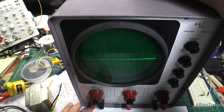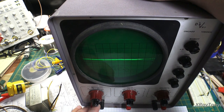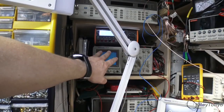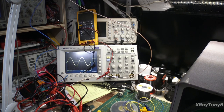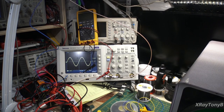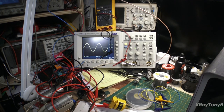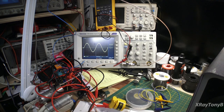That was a little while ago. Anyway, that's the basics of what an oscilloscope does and how you would use it in the very most rudimentary form. Now, for the next video, we're going to talk a little bit more about these scopes, okay? This is actually still pretty modern, but that's kind of the next version I have anyways. We're going to look at things like DC inputs, at triggers, what a trigger is, and we're going to look at calibrated horizontal sweep time, and I mean calibrated horizontal sweep time, okay, where we could actually measure these graticules and know the frequency of that signal from measuring how many graticules, okay? So that's what the next video is going to do.